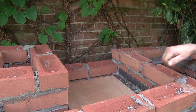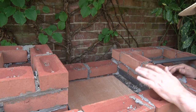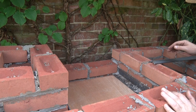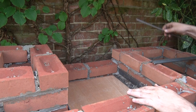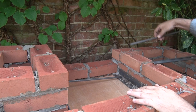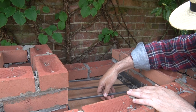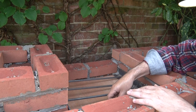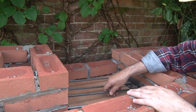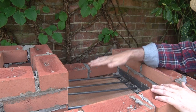Here's the bottom of our wooden panel in place and this is where our concrete slab is going to go. I'm hopefully going to get this about two bricks deep, so it's going to be a fairly solid thick piece of slab and it'll give us lots of thermal mass. What I'm also going to do is put in these reinforcing rods between the various bits of steel work — this is just 10mm rod and I shall put five or six of these in. There'll be some reinforcing mesh as well, which should give the slab at the top lots and lots of strength.